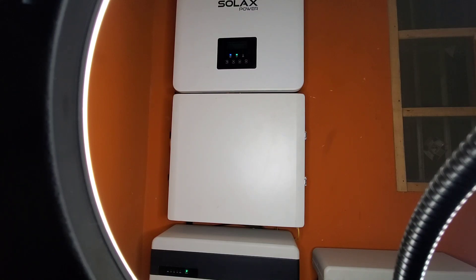Let me tell you about this particular inverter and compare it to a similar Victron and a similar Schneider. This inverter is a five kilowatt, has two charge controllers built in for a total of 7,500 watts in PV. I can discharge 5,000 watts continuously on battery, and for one hour I could discharge 6,500 watts. A prime advantage is a high voltage system — if I'm pushing, I can push through a lot of energy without increasing the amount of current I push through.